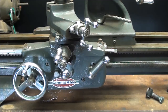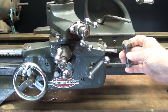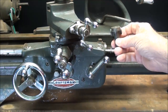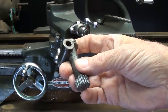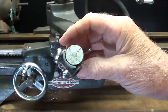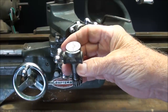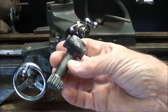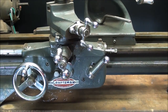I'm not going to talk too much about the setup, but simply show you how to keep your tool in alignment — synchronized — without using a dial. Either you don't have one of these, you lost it, or some older lathes are not equipped with it. I know that some of the small Atlas lathes, the 6-inchers, do not have this. You can buy these over eBay if you do not have one. This little gear of course rides on the lead screw and helps you synchronize the thread as you repeat your cuts.